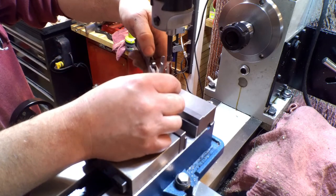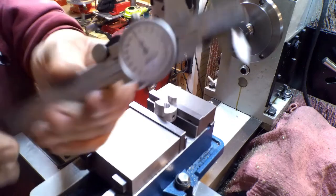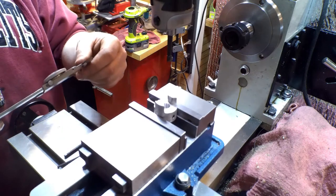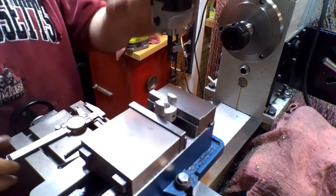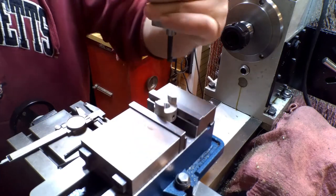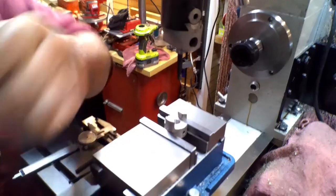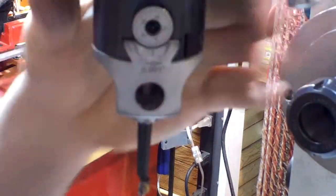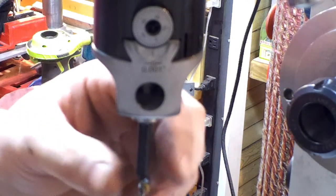Lock this down, set it right on the hole. I think I'm about half a tenth off, which is good enough for me — you can always polish it a bit. So the good news is the adjustment dial on this boring head is precise. Really fine adjustment — you can dial in a couple of thousandths. I'm very happy with this.